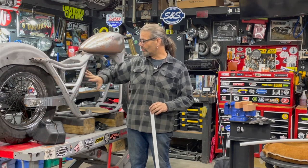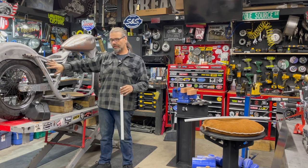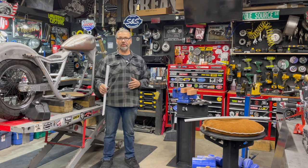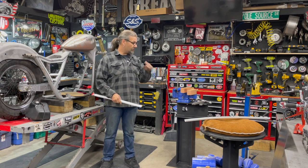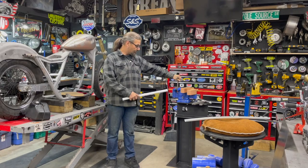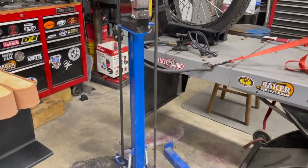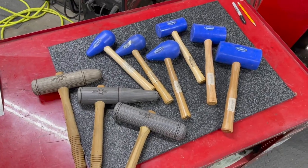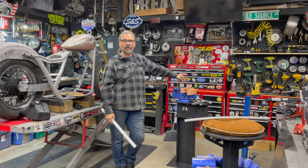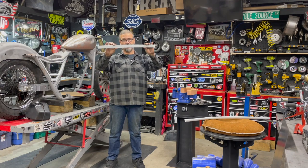This gives you the ability to really get a nice model. I like to have the actual inset dimensions back here so that when we make our pieces that fold over, it's going to sit in there nice and tight without leaving gaps. Throughout this process, as we take some regular 18-gauge sheet steel and make these side covers, we're going to be using a lot of the tools in the garage — starting with the EVA modeling today, then moving on to T-dollies, slap hammers, the shrinker and stretcher, the beater bag, some hammers, and the planishing hammer. We'll do cycles of this until we find a good groove for our side covers.